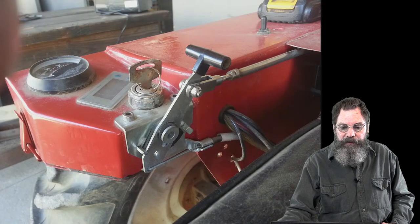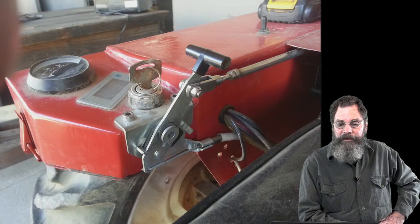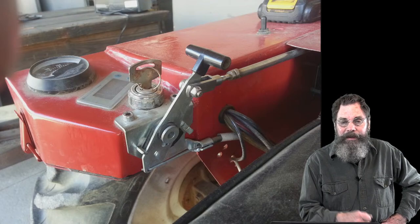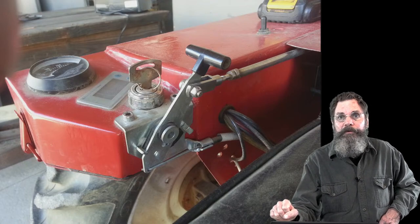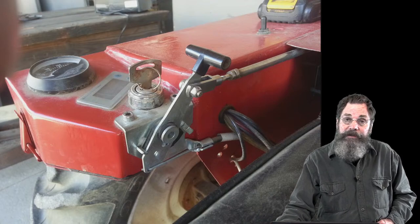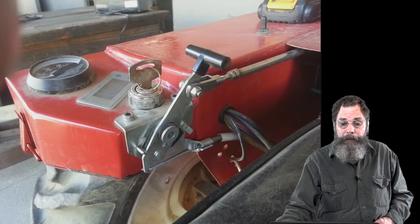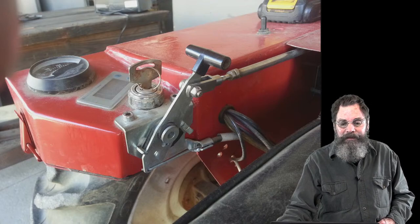This is a close-up of the control system on the right side of the tractor. You can get an idea when I said I wrapped the cable that originally came with the throttle lever, sort of wrap it up in a loop because I like the resistance it gives. You have to push the throttle forward and back and you feel it. If I had snipped that cable off, it probably would have been too easy to do that. And we have an ignition key, of course, I forgot. That's a 12-volt key that goes directly to the contactor through fuses, and it energizes the 48-volt system. That's essentially it. It doesn't have a starter, like you don't turn it to the right all the way and it starts. It's just one click and it's on, back the click and it's off.